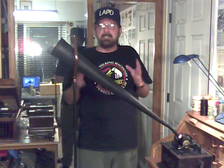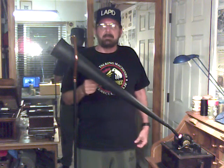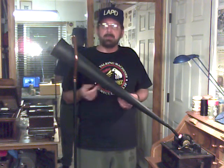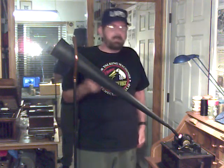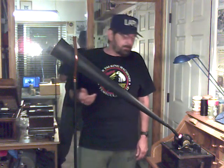It's an easy adjustment to make. Usually it requires pulling the stylus off the diaphragm, realigning it, and gluing it back. I use white glue, or you can use carpenter's wood glue — it makes a very quick-drying, nice bond that you can pull back off again. You want to be careful with the adhesive you use. The original adhesive was shellac, which is why styluses have broken off over the years.